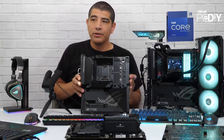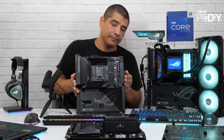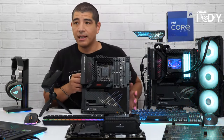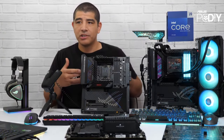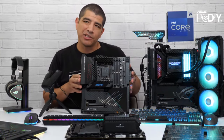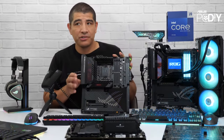So you will notice that of course on this board, it does have right angle connectors. That is something you do want to keep in mind when you're dealing with a right angle based design. You do want to be a little bit more cautious because there can be more considerations when you install this into a chassis. So you can more likely run into mechanical obstruction. It's nice because it looks pretty clean and it's pretty cool, but it's not always ideal depending on the chassis. So just make sure that your chassis has enough room.